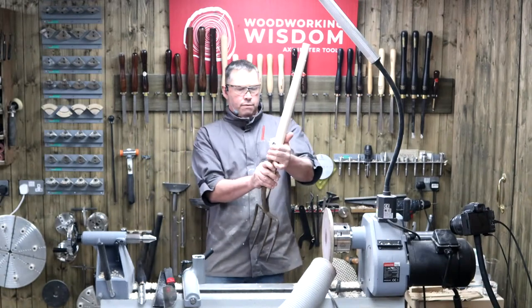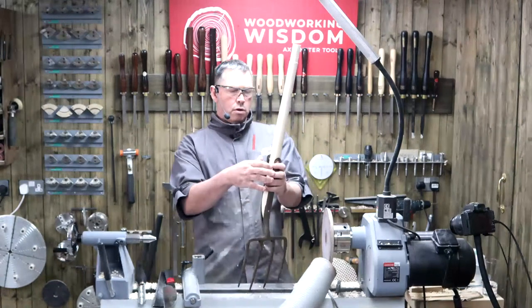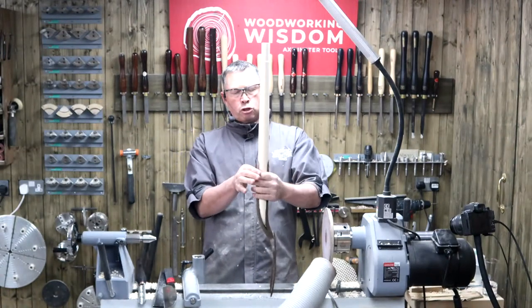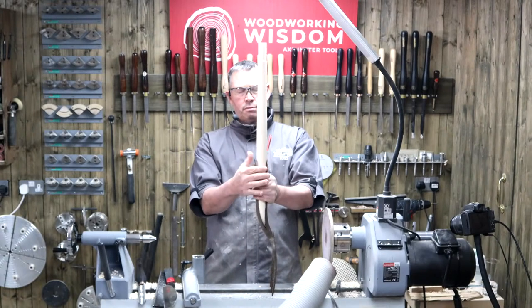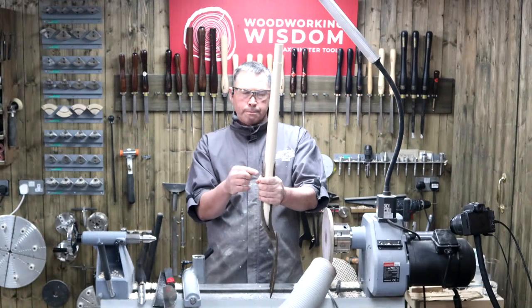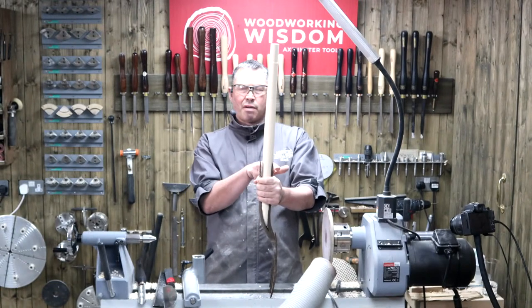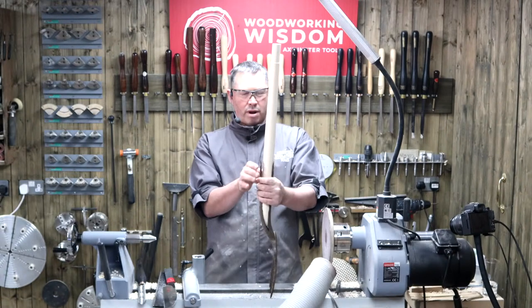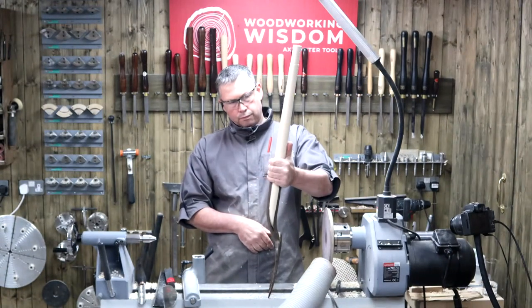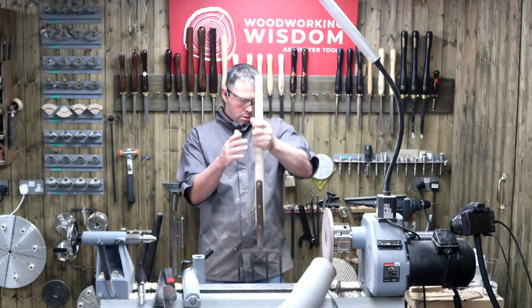So by the time we've got, and I'm not going to use rivets. So originally, this was riveted together. I'm going to use countersunk machine screws, and these top two are really quite thin, this material here, so I'm going to re-drill some holes and put them in different places and only come in from one side on each, so they're not going to be joined up, otherwise I'll have a bolt and nut on the other end. So I'm going to come in from both sides just with a separate screw. There we are. So let's get the top done.